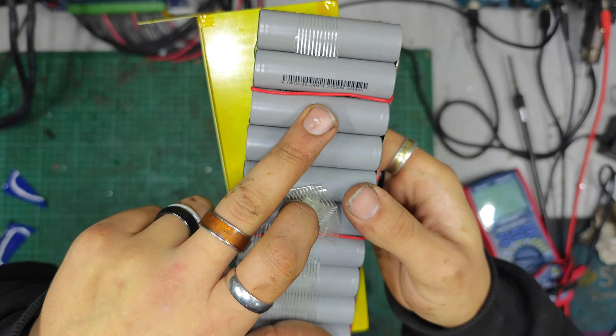I'm going to be honest, it's made a little poorly. There's no insulation between any of the cell groups, so theoretically if they rub together enough they could short out. It's not ideal. Got our JST here — split. Horrible BMS situation in the middle. Don't like that, but it is what it is.